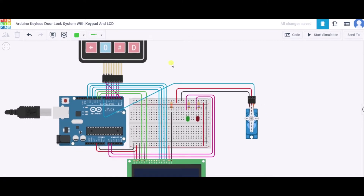Now let us see how to connect the LEDs. We will connect the anode terminal of each LED to pins A1 and A0 of the Arduino. The cathode terminal of each LED will be connected through a resistor, and the second terminal of the resistor will be connected to the GND pin of the Arduino.